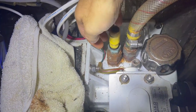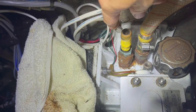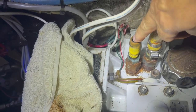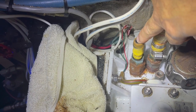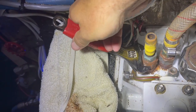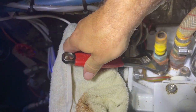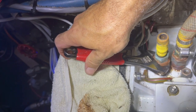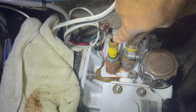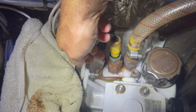What you're looking at here is this used to be an old compression fitting that I removed. The reason I did that is this necks down to a half inch. I wanted to put on a three-quarter inch hose so I could increase the flow through the cooling circuit. But what's happening here is this fitting is relatively loose, and it's moving this tube. I believe this tube is part of the cooling circuit, but it's hard to discern from the drawing. And if I turn this, I'm afraid I'm going to break the fitting inside the cooling unit.